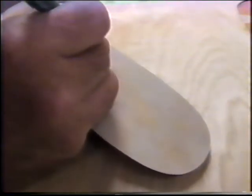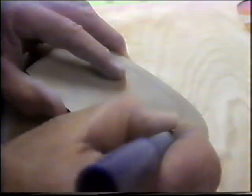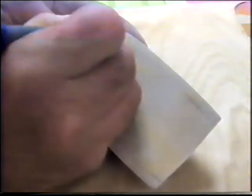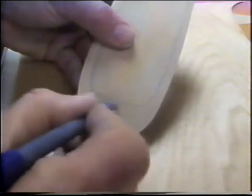Now, I'm just going to interpolate this, I guess about a quarter of an inch. I want to leave the back piece in here and a radius. Just rough it out for now. The reason for this is I want to be able to put the bolt hold down piece in there, and this will of course be the part that holds it on. This is just to rough my cutter out when I Dremel this out, and leave that back piece in there.